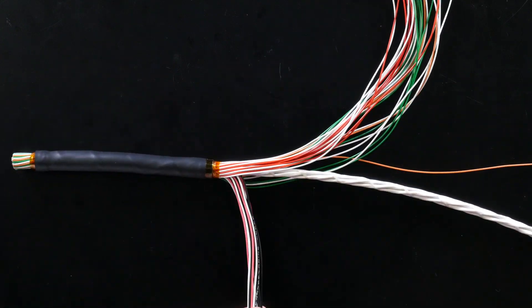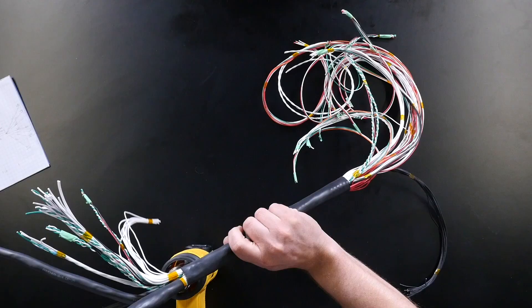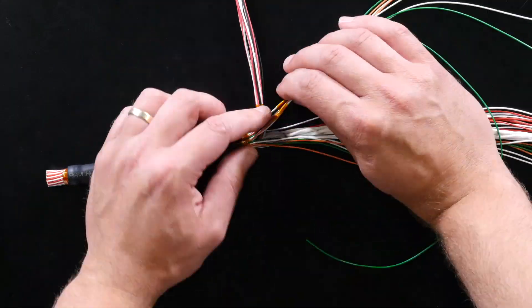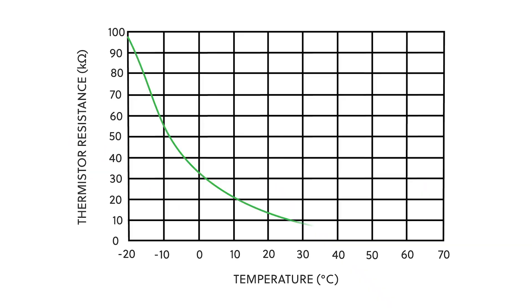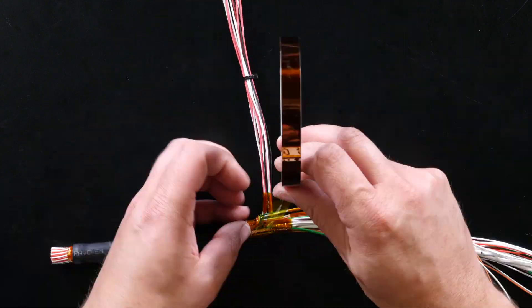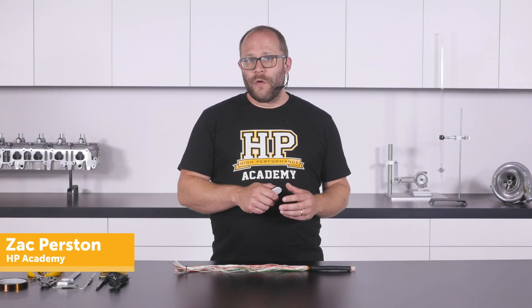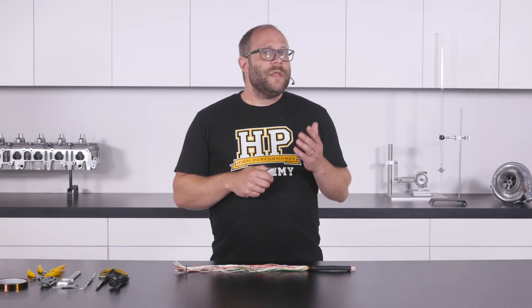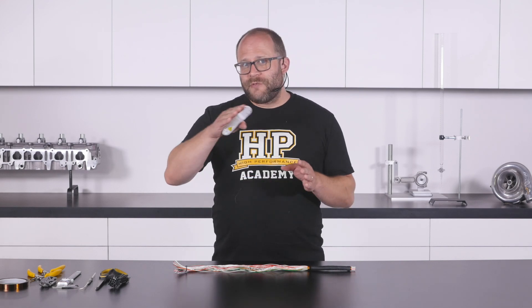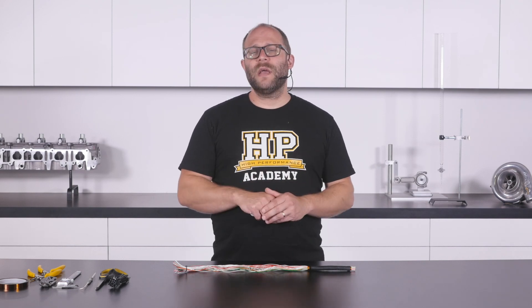The points where our harness needs to branch tend to be the most complicated sections to construct tidily. Often we will encounter a situation where a branch will contain wires from multiple different layers of the harness section from which it is branching out, making it difficult to tidily gather those wires together to form the new branch. Our aim is for all wires to head off down their required branches without strain at the branch point, which can mean wires needing to twist around from one side of the harness to exit out the other, and can end up looking a little untidy.